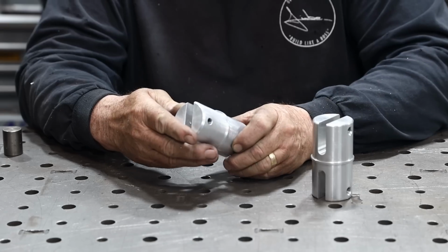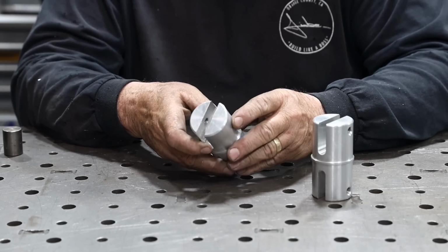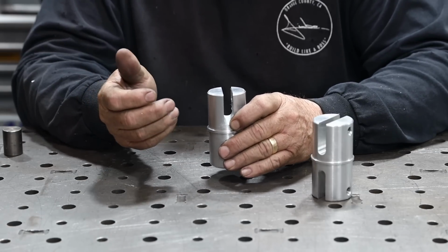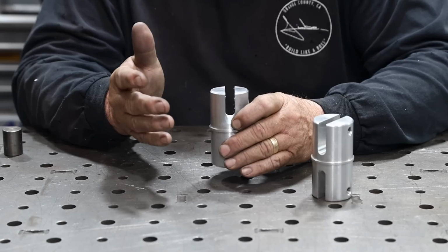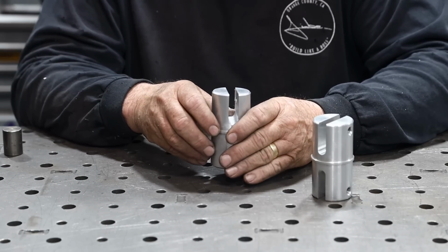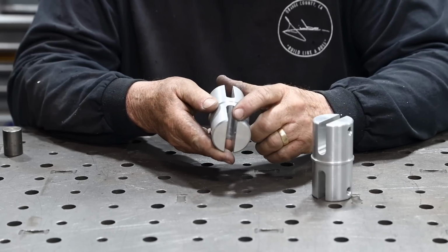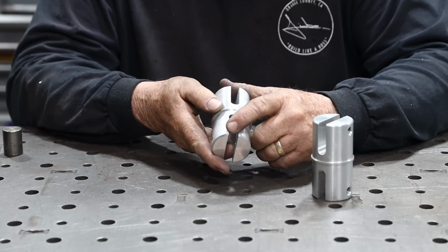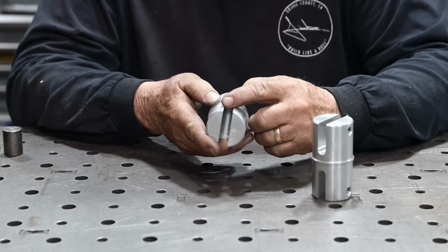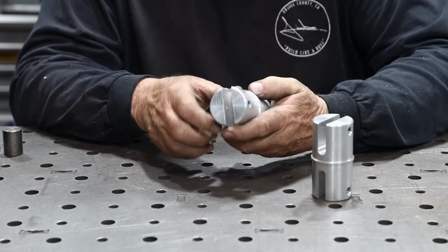When I first cut the groove, or the channel in here, you saw that I didn't use any kind of coolant, and that's just a lack of experience on my part. I'm not a machinist, you know, don't judge please, but I do the best I can, and I'm learning every day. So what happened is I cut this and it started loading up, and the end mill started to slightly get off course right here and started to make a little bit of a rough cut, and that's why you see that that is the way it is.